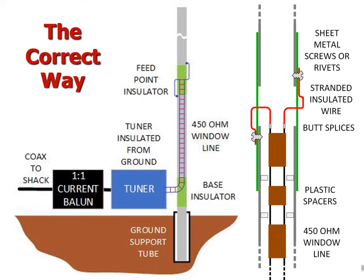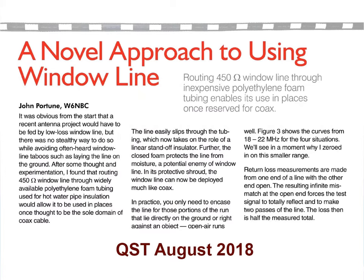Some may ask why I chose the height of 20% for the feed point. It is largely arbitrary — vector network analysis shows that placing the feed point at that height yields a somewhat easier range of feed point impedances for the autotuner across the HF bands, and it's easy to reach. Some may question running open wire line through metal tubing, as it seems to run counter to common ham wisdom. But open wire transmission line works very well inside metal tubing, as well as in a number of other situations often considered unsuitable by most hams. Read my article about that in the August 2018 issue of QST.